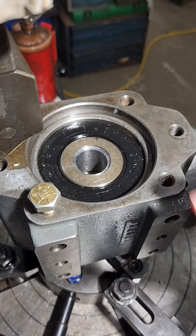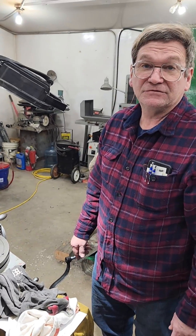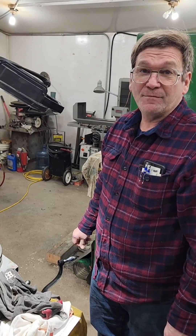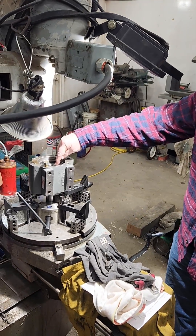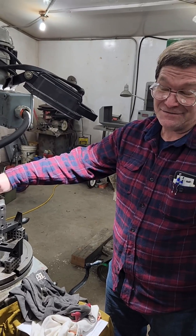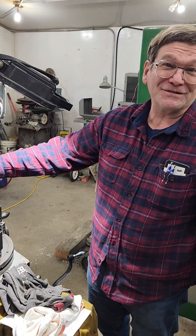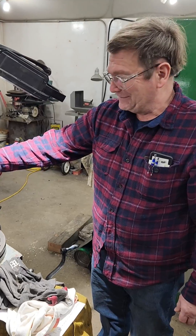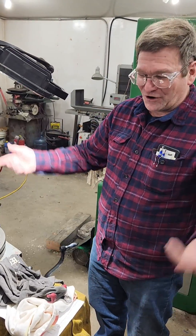This particular type of slotter — you can't use carbide tooling with it, so you're limited on how hard of materials you can cut. We did a Rockwell test on the top of this before we counter-bored it. We didn't try testing it before we tried cutting it — we wanted to ruin a tool first instead of doing testing. Sometimes we just do things that way. It's so much more cost effective to ruin things than to actually test.